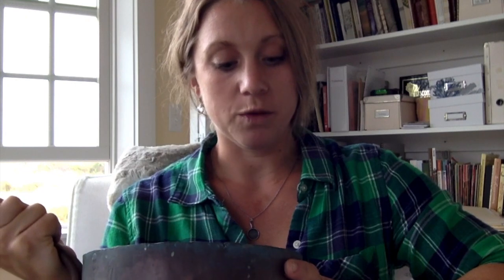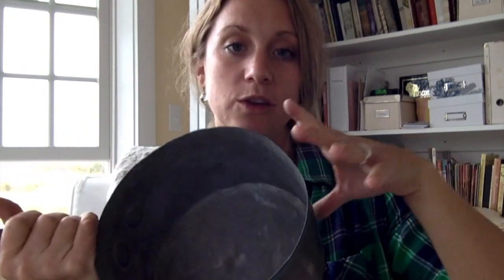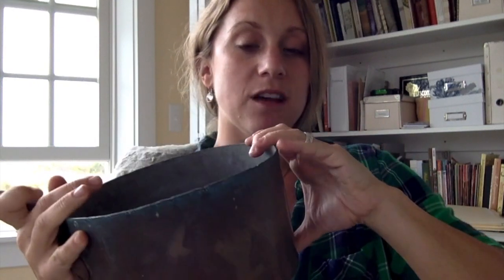Do you see how this isn't round? Some copper is very malleable when it's in the flat, but this is not — usually when it's in this shape and thinness. Because this has been heated so many times over the stove over the centuries, it has become heat-treated. I can fix that by reheating it hot enough so I can take some of these flattened edges out and fix the dents. It's still really delicate work, but you can reform it by softening the copper. If you left it as-is, it's actually a really solid piece because of the heat it's endured — it's work-hardened.